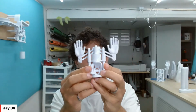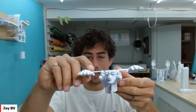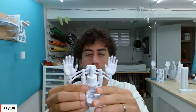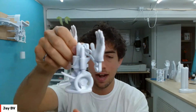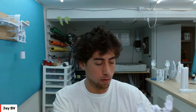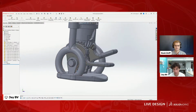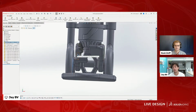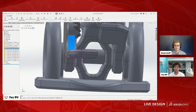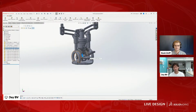One thing to keep in mind, though, is when you're doing stuff with 3D printable tolerances, everything's kind of loose. It's not the most ideal if you're trying to create a perfect assembly. That's why on this shaft, I added these side flanges to give these gears a little bit less wiggle. If we jump into CAD, you can see better what I'm talking about. It's these side flanges right here, which I gave to support the gears, where if these gears were supported by bearings and threads, you could get away without these because the clearances are way tighter.